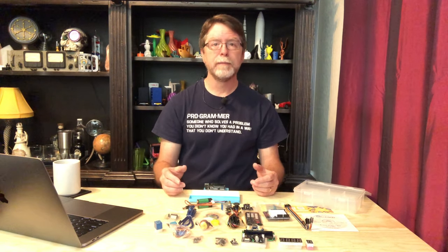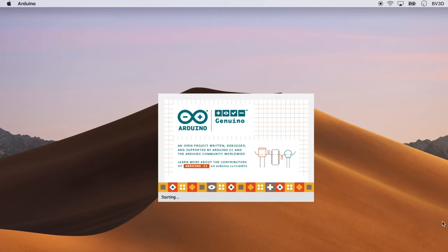I'm walking you through the lesson using the guide, but if you want to refer back to it, it starts on page 31. Launch the Arduino IDE. You may notice that it opens a window whose name begins with the word 'sketch.' Arduino programs are called sketches — the term may stem from the concept of quickly sketching out an idea and sending it to the Arduino to test it out. You'll also notice that this sketch already has a little bit of code in it, and in all reality it is valid code that you can compile and send to the Arduino, but it won't do anything. Let's change that.